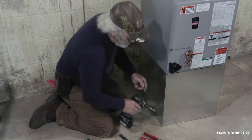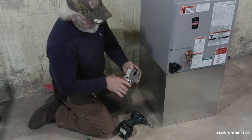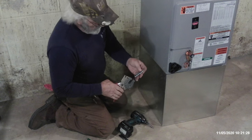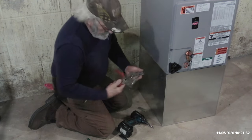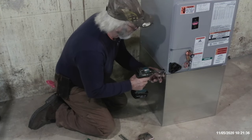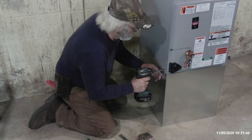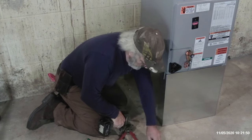You can back out that screw. Now I like to use this Malco punch. This is a light duty version of the old tried and true Whitney punch, but I use this Malco punch to get me a pilot hole. Use that existing screw. Set that in place.